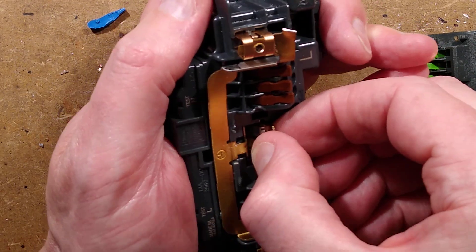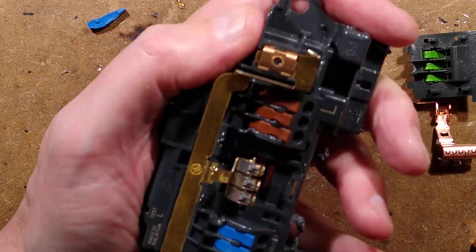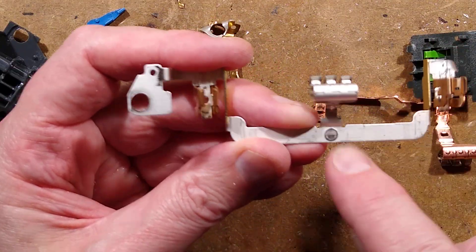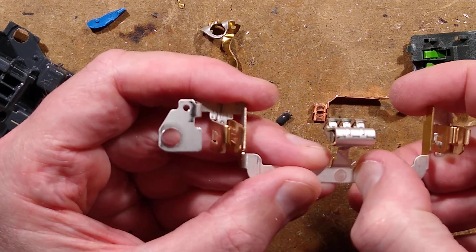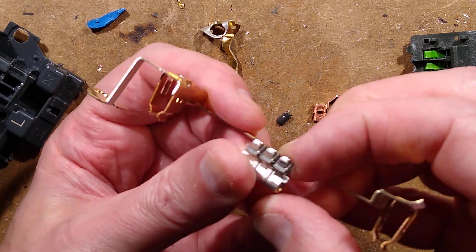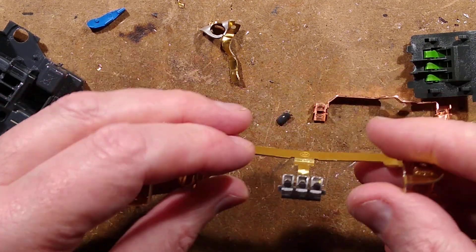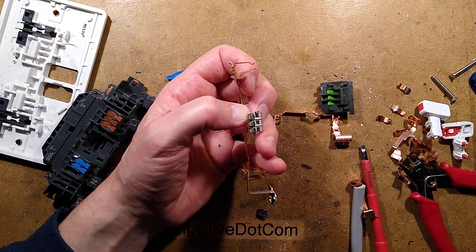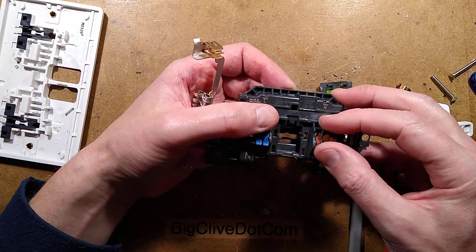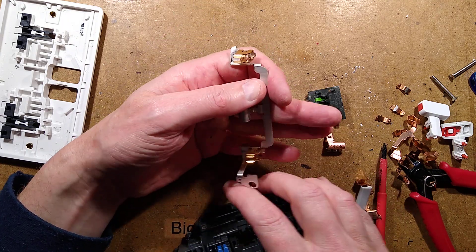It seems okay actually — I think I'm happy with this. It looks alright indeed. After that little concern about the busbar metal and finding it is just plated brass. I wonder why they've done that — is it silver? It could be silver plating on the brass. Not really sure. But it's the same arrangement — it's got the little cluster of terminals here that can be pushed down to actually clamp onto that. Yeah, it's neat. This could well be the way ahead. I wonder if they're just testing the water first by putting out the sockets, and then the switches will follow. Because it will effectively require quite a radical redesign of the sockets. Certainly this looks not bad, and the depth isn't really significantly different to a normal socket. So there we go — the MK sockets.